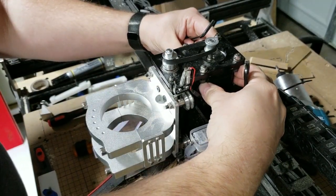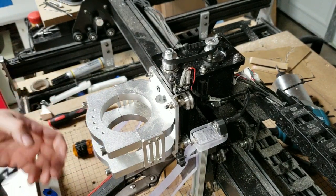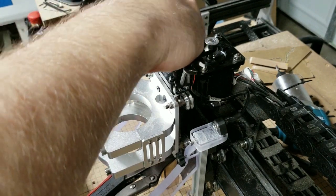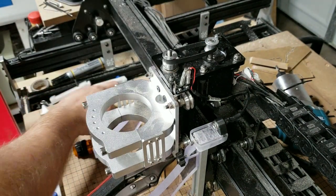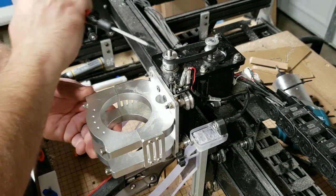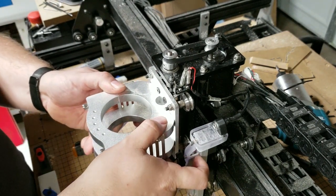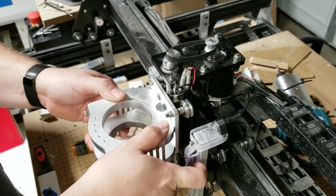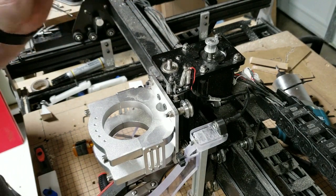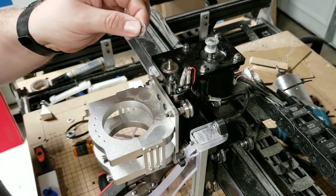Once that's loose, we can move the motor forward. Now that we have this clamped securely, we can take our 10mm wrench and go ahead and remove the nut completely. You want to hold on to the carriage for the spindle, loosen the 1.5mm Allen set screws that hold this pulley on, and then you'll want to intentionally just drop it — don't let it slam. It doesn't have to go all the way down, just enough where you can take this assembly off. The washer that's supplied with the machine does not get reused. We give you a precision shim instead of a stamped washer.